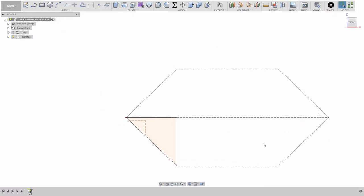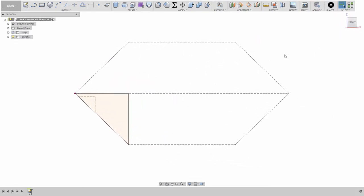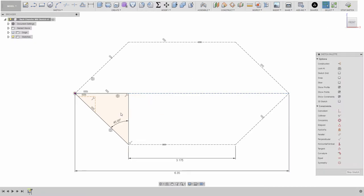I've created a sketch that is basically the same thing — this is the triangle we're going to use. We can see our 45 degree angle, and this line has a width of 0.5 millimeters. The offset from the tip of the tool to the start of the chamfer is 0.1 millimeters. Our end goal is to calculate this value right here: 0.9875.